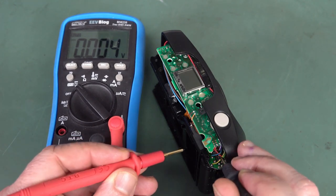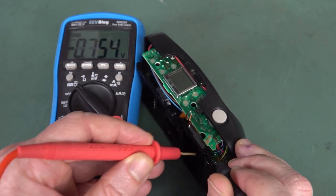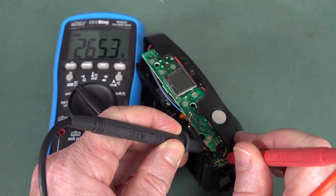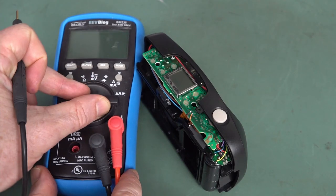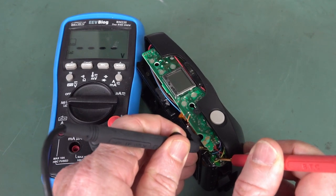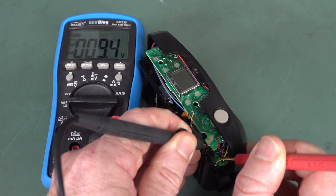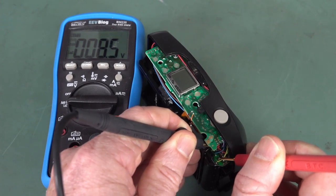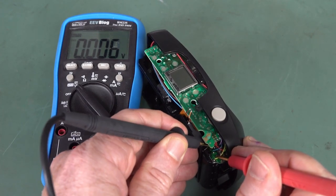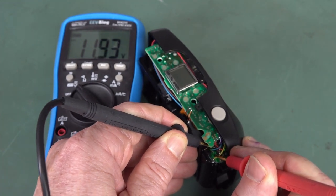Let's see if we can find the contacts. Ta-da — 267 volts, back to front. All the electrons are falling out. 265 volts — that sucker's charged up. So we want to put that on auto-V mode which will put in a couple of kilohm load and we'll see that go down pretty quickly. 70, 80 volts, 34 volts, 19 volts, 12 volts — boom boom boom, we're discharging that. We'll get some recovery on that if we put it back to volts — high impedance — then probe it again. Look at that, dielectric recovery. But it's not going to go back up to 300 volts. That's safe to work on now.